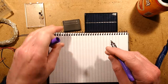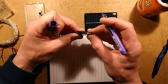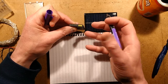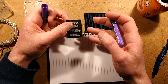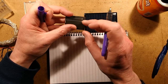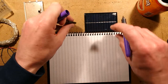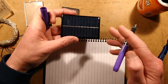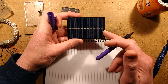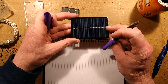Here's the plan. These batteries usually contain protection circuitry — the Nokia ones all contain the little protection circuit board built onto the same circuit board as the little gold contacts. They have the DW01 style chip that automatically shuts off if you overcharge or over-discharge it. So charging this, you can literally solder onto these charger connections — marked plus and minus — and charge it with a current-limited supply. As soon as it reaches its limit, it will automatically turn off. That makes it dead easy with this solar panel. If you count the number of strips — it's 12 strips — that's roughly half a volt per strip, equating to a total of 6 volts. I'd guess it's going to be about 100 milliamp from the size, maybe a bit more, especially in direct sunlight.